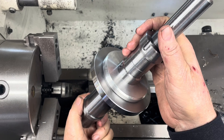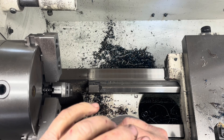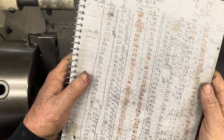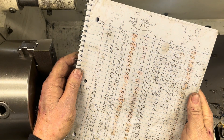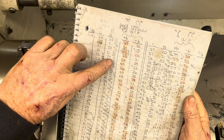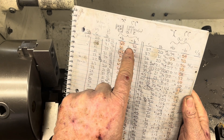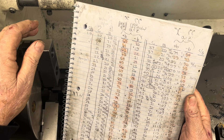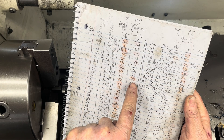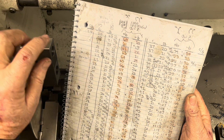This will be a 64-tooth gear in 14 DP in about an hour. Consulting my well-loved change gear table, we're going to make 64 — that's a 44 over 40 on the differential loop with the rotation reversed, so with an extra idler. I need to make a 28 the next time around, and that'll be a 48 over 40 without the idler.